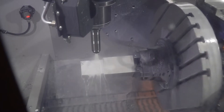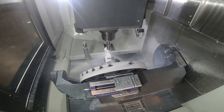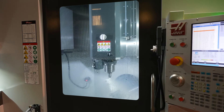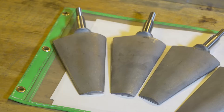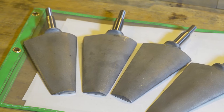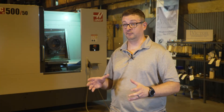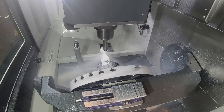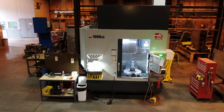The justification for the UMC was to really allow us to get our foot in the door with some of the aerospace parts that customers keep bringing to us. It doesn't have to be an aerospace company — there are impellers and diffusers, all sorts of vane and aero shapes that go in a lot of different things, but you really need a five axis machine. Currently I'm running existing customer parts to prove out processes, moving things away from four axis, cutting from two operations to one or three operations to two. On parts I've proven out, I've brought cycle times down from 30 to 40 minutes to under 15.